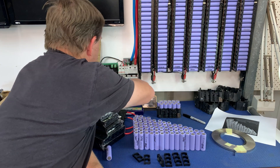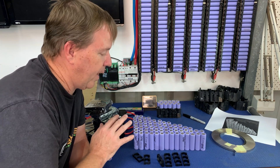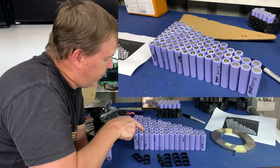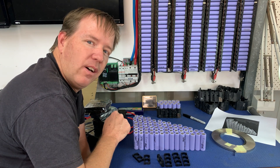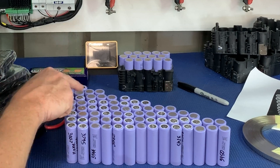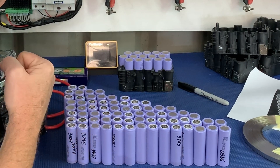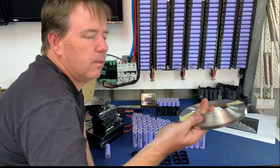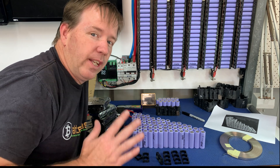Now I don't really know how to build this, so this is where the community support comes in and lets me sort of throw some ideas around. If you have a look in this clip, I had it set up so it was five cells, then up to here, then five, five — negative, positive, negative, positive — just winding my way down the pack. I figured that that length wouldn't allow the current transfer in the most efficient way. So I've grouped them in fives and tried to wrap them around so there are smaller, tighter groups of nickel and I can really get that current flowing. It'll be a 5P14S battery pack, done with nickel strip, wrapped up in heat shrink. We're not using any fusing, only the nickel strip.